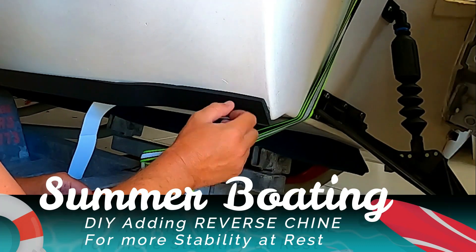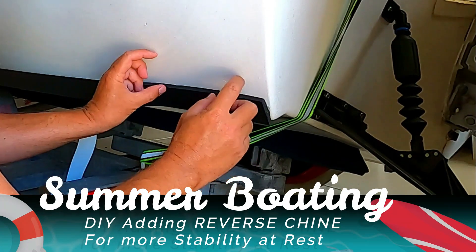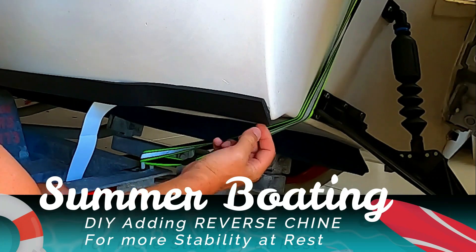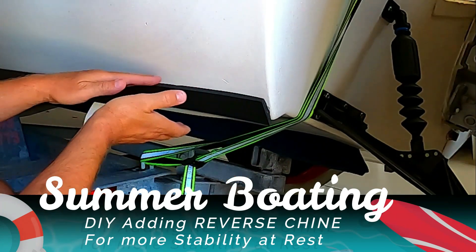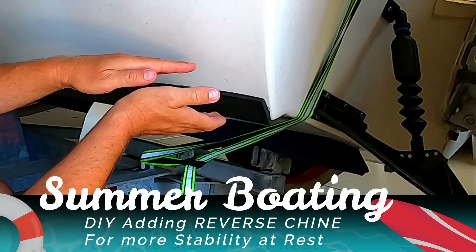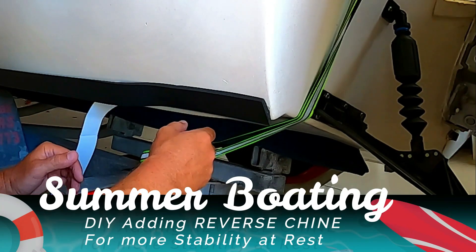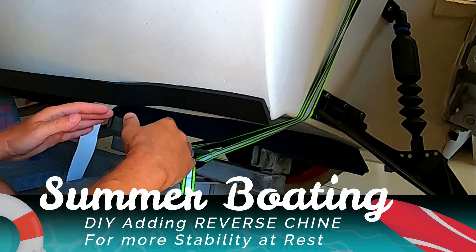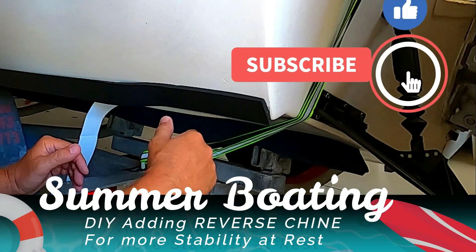These ones here are 50 mm wide, which is 2 inch, and they're about half an inch in thickness. So you could double that up — make it a whole inch in thickness — or you could add another one on the top to make it 4 inch in width, or even add it underneath, depending on the shape of your hull and where it needs stability. You're wanting to create some flare out the side in order to give you that chine, so that when the boat hull tries to pull under water this keeps it stabilized. We've already tried these reverse chines on this boat and another boat and it does make a lot of difference — not huge, but just enough to give you that little bit more stability at rest and straight-line driving when cruising.